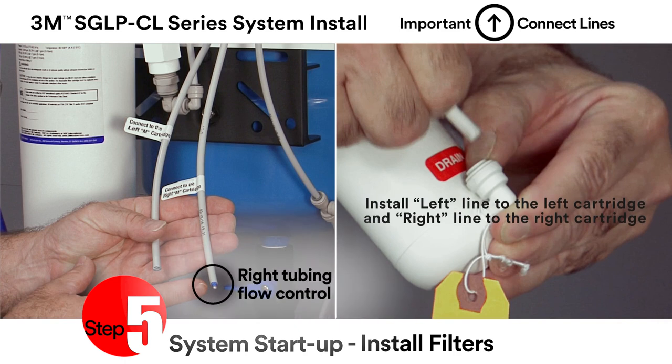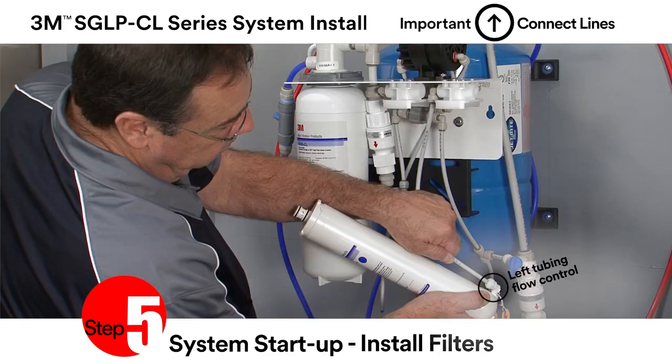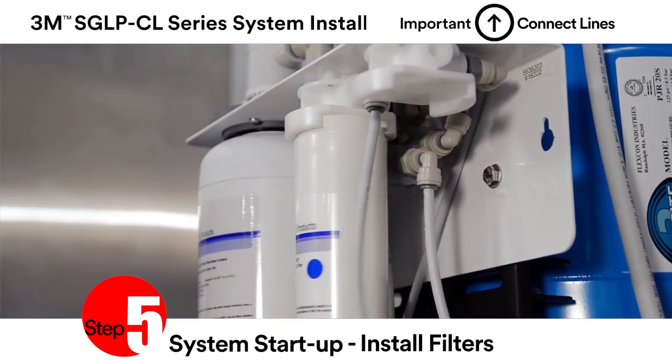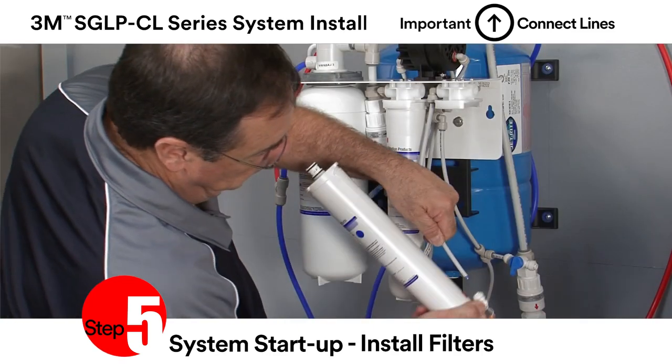Remove the plug from the bottom of one of the RO membranes by pushing down the collar on the white quick connect fitting and pulling the plug out. Remove the red cap from the RO membrane, then connect the gray tube into the quick connect fitting, making sure to use the tube labeled for the left RO membrane. Insert the RO membrane into the left head and rotate 1/4 turn to the right until the cartridge stops. Repeat for the right membrane.